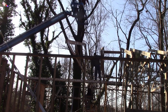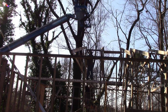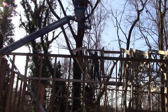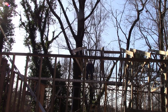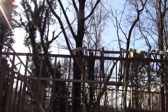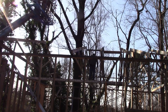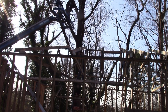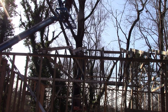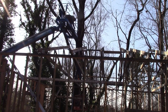My dad nails a board between the trusses to keep them from falling. On the very end of the shop there's a two by six going from the wall straight up, holding the gable end and keeping everything from falling toward us or away from us. That's how we did it — I'm not sure if there's a better procedure, but this one seemed to be working pretty well. We were able to get all the trusses set in a matter of a few hours. We did have some trouble with one of the lifts we rented — it wouldn't rotate at all — so we had to call it quits and rent another lift another time.